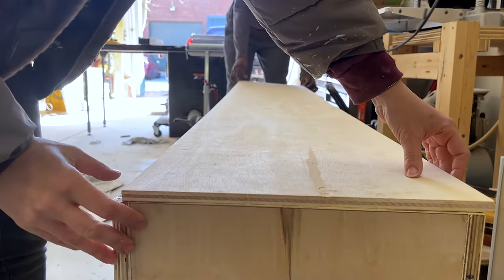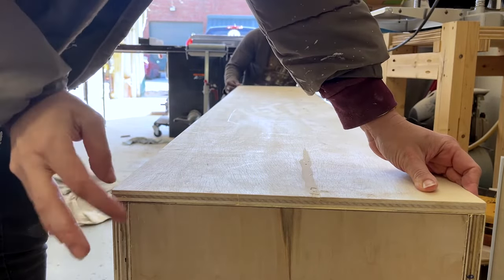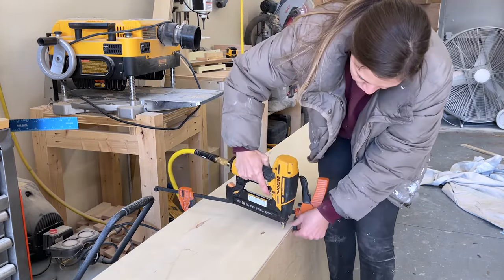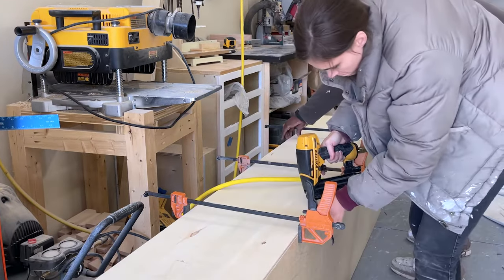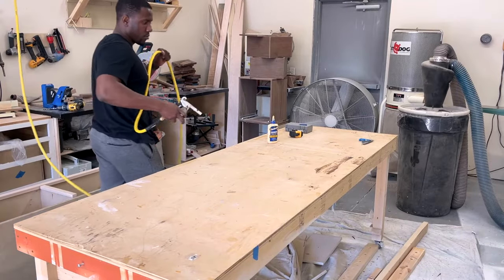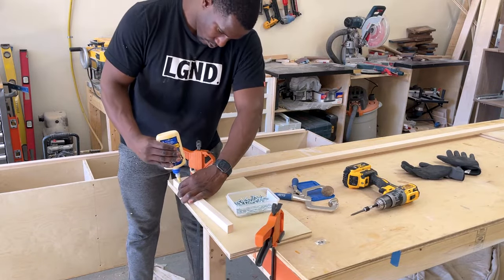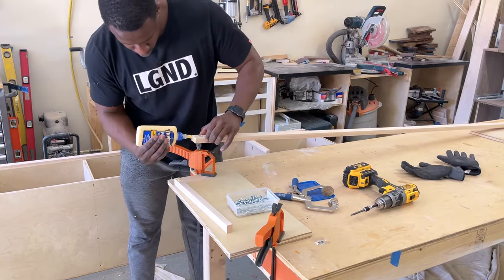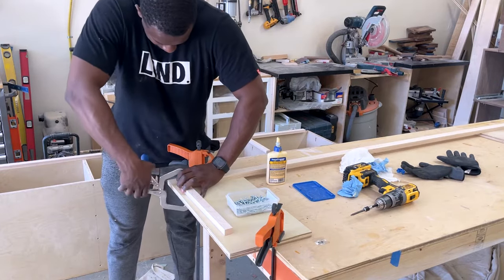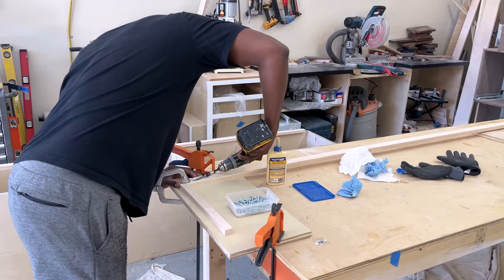Keep in mind the sizing: if you do this method you want to make sure you factor in how thick your back piece is compared to the size of your box. Our space was 23 and a quarter inches, so we had to make sure the box with the back and face frame didn't exceed that measurement. In the five do's and don'ts video I mentioned formats of joinery for face frames — here we're using pocket holes because you'll never see the back side of the face frame.